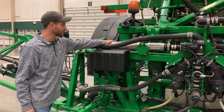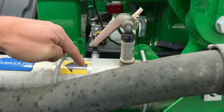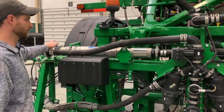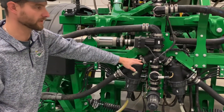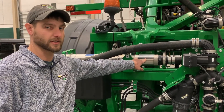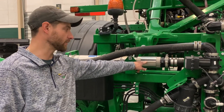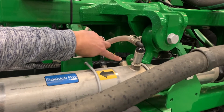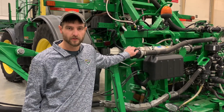On our boom, this is our mixing chamber. Our line comes in here from the direct inject pump to this check valve and into the mixing chamber. When you're spraying, you have solution coming out of your main solution tank through here, comes through the mixing chamber, and picks up your solution direct from the direct inject. Then it goes to the Y-manifold out to the entire boom. There is a check valve here so that you don't get solution going back into the direct inject system. Most of them have a plastic check valve here; the stainless steel one is an option. If we were direct injecting more than one product at a time with more than one pump, you would have another check valve and elbow here for your low volume as well. If you have any other questions on your direct inject system, you can contact your local Landmark dealer.